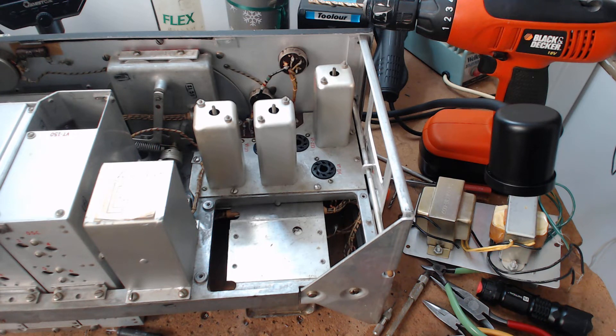The one thing you've got to remember - very important - the minus of the high voltage is floating and it goes to a network around the audio amp and then to the rest of the set. It doesn't get grounded. There are people that redraw other people's schematics and put their name on them; they'll show the high voltage minus going to ground and that'll cause distortion in your audio because you won't have the correct biasing.